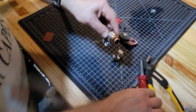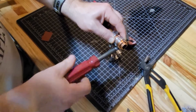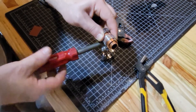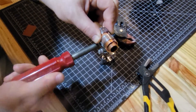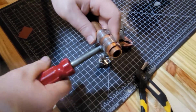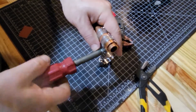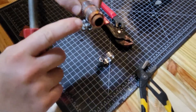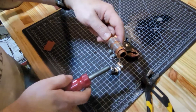Next thing we're going to do is tighten these a little bit. The reason we cut that three-quarter inch pipe and put it on top of the half-inch pipe, instead of just using a gasket with this, is that it applies a uniform pressure all the way across it. So if you have that pinhole leak, you tighten this. Remember, the center of the gasket is right on top of that. As you tighten this, it applies pressure onto the copper pipe, which applies pressure to the gasket, which is going to seal the leak.